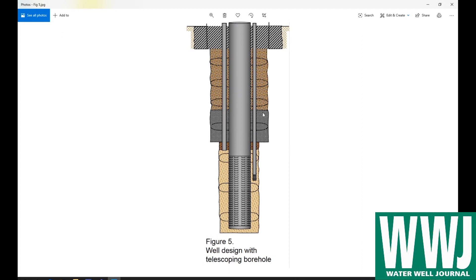I've been very open in a lot of presentations that I'm not a big fan of annular tubing strings. The reason is we have the cement here, and when cement hardens, it shrinks — it doesn't swell — so we may have a micro annulus adjacent to these. And we draw them as a perfectly plumb, aligned well, but that's not reality. These will be laying against the borehole wall in some intervals and laying against the casing in others. We could have a situation where poor quality water in the shallow aquifer — which could be aggressive or corrosive — may find its way adjacent to this annular tubing string and then down into the well. That's bad. So we want to avoid that, though some well owners want these and we will continue to put them in.